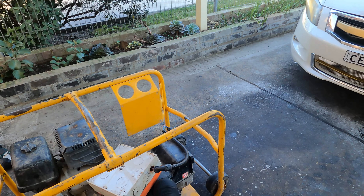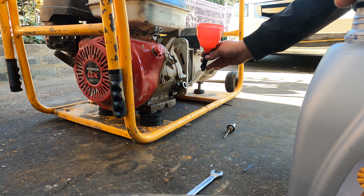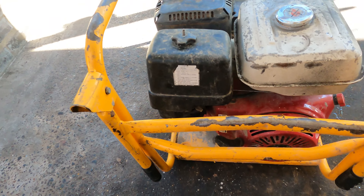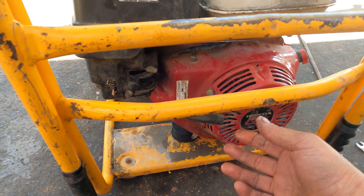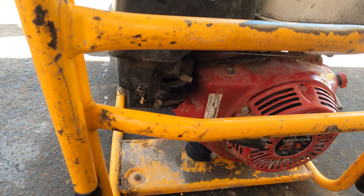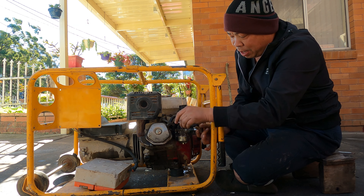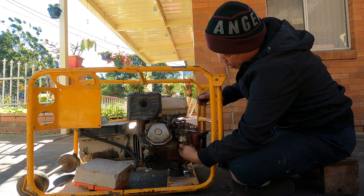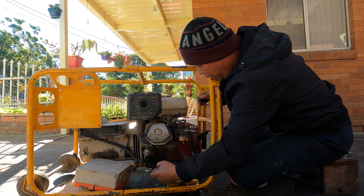Test the generator, do a service on the box, check the power, and put oil on. You can go 20-50 or 15-40 — better for the generator. Fix the carburetor — you can see how much it tilted back because when it fell down it dropped, and this part bent, so air is leaking into the carby. All we have to do is take a number 10, take it all off, bend it straight, clean the carby, and put it back. Time for the carby — be patient. Take them out, straighten them out. Do a bit of cleanup — it's very dirty, a lot of gunk in there. Clean up before we put them back in.